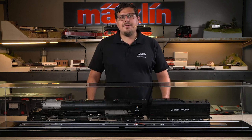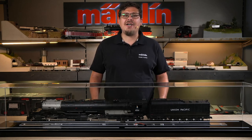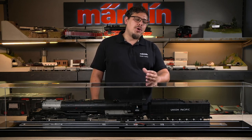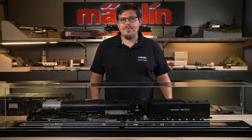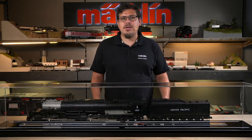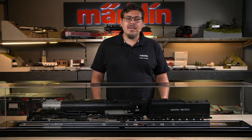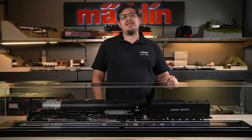Included in the packaging of our functional display case is a 100 VA switching power supply. Furthermore, there is also a connecting cable that is plugged in between the locomotive and the function showcase. We have specially chosen not to use wheel sliding contacts here, so we use this cable for the fixed connection. There is also an extra WLAN stick, which you also have to plug in manually.